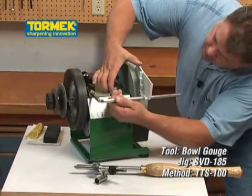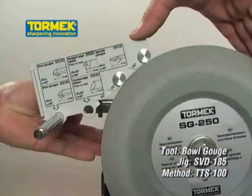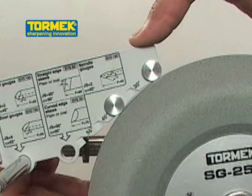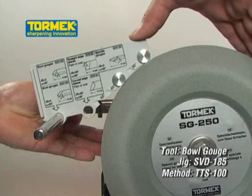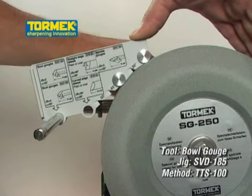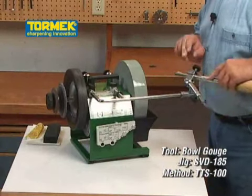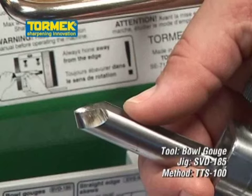Set the universal support with the setter. Position the universal support so that both of the contact discs are in touch with the grindstone. Now the setting is perfect, irrespective of the wheel diameter. Sharpen the edge by swinging the tool from side to side whilst moving across the stone.